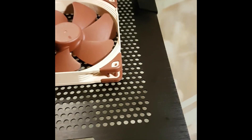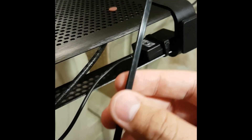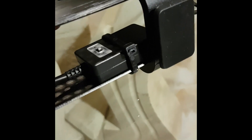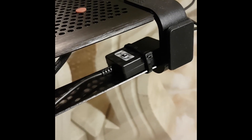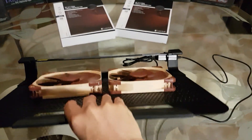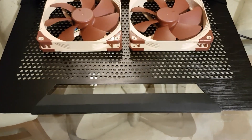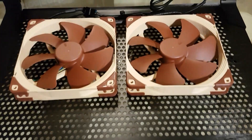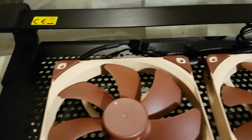This is how it looks with two fans. The final thing is to do some cable management. I recommend staying below 1500 RPM fans to get almost complete silence at full speed. But if you want, you can use any 12V fan — just make sure you check the amp consumption first and you'll be okay.